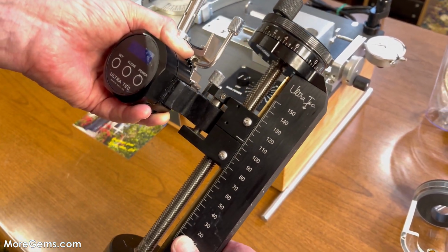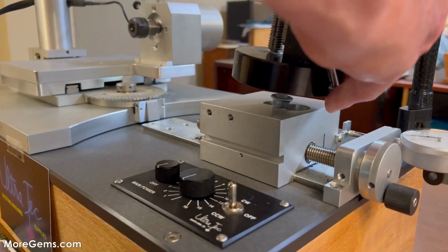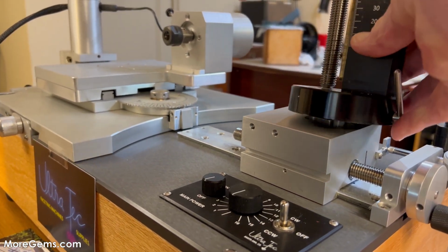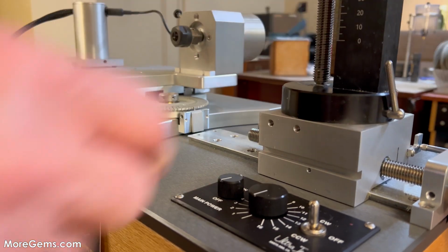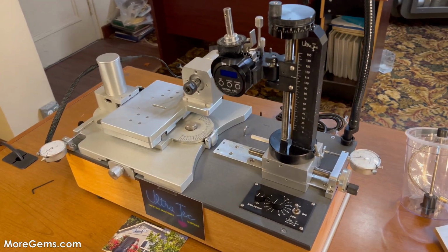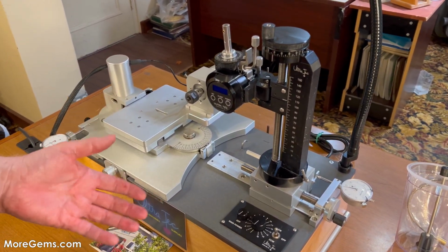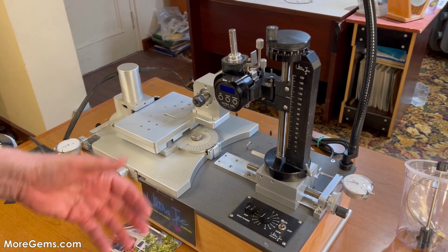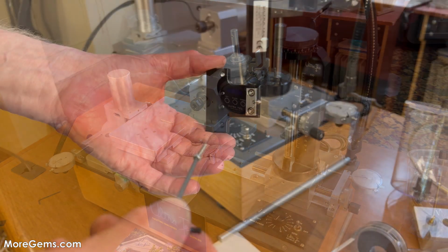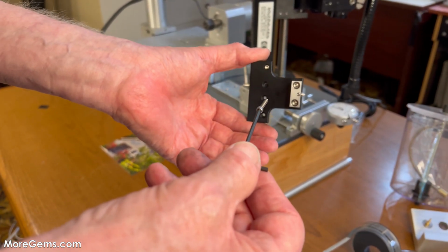So here's the mast for my Ultratec V5 flat faceting machine that actually goes on this machine the same way it does on the faceting machine. So that's easy, but there is some setup to this, which they say the first time can take 20-25 minutes. You can get it all marked out to where it may only take 5 minutes each time you set up. Or the other option is to buy another mast and have it dedicated to the machine. Now keep in mind that I'm new at this, so we hope we'll get all this right.